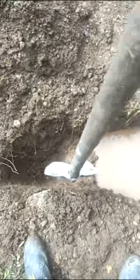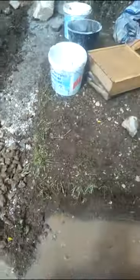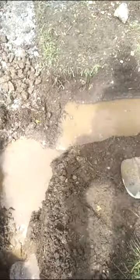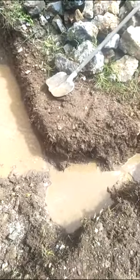I just need to make sure for one first that I can dig it far away, so when this is structural I don't mess it up when I come here to dig my drain out later. But as long as the water is naturally flowing away, which I'll start now with that, that'll get it going. Now it'll pull all my water from my high points to my low points away from my structure. I might have to help it a little bit.